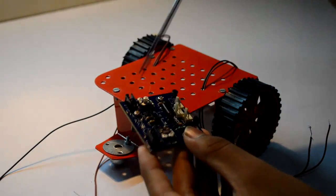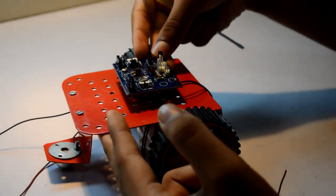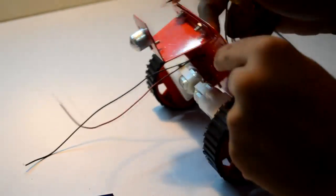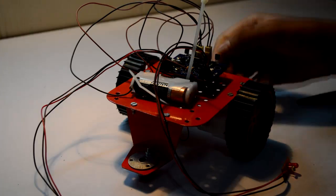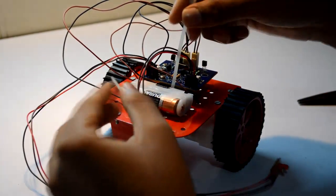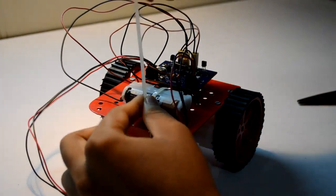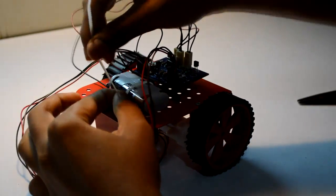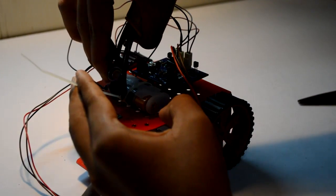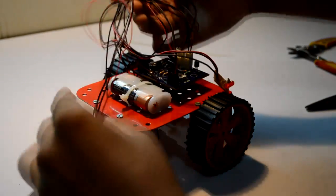Now take some spacers and attach them to your PCB with the help of some screws, then try to attach the same to the body with a couple of screws. Also bring in the wires of the motors and solder them. The PCB has been fixed and the motors have been soldered. The next thing is to fix the battery — I have the cable tie from underneath the chassis, and all you have to do is tighten it so the battery fits perfectly. Cut the extra part to avoid interference. Also take another cable tie and tie around all the cables, including the sensor cables.